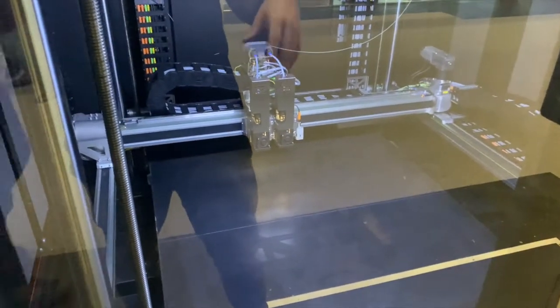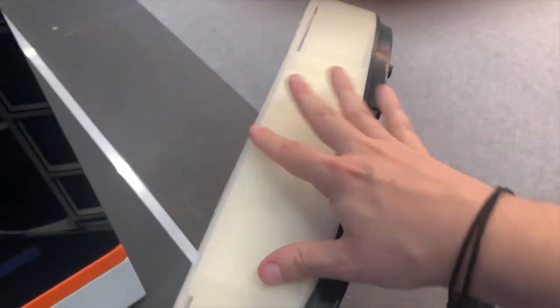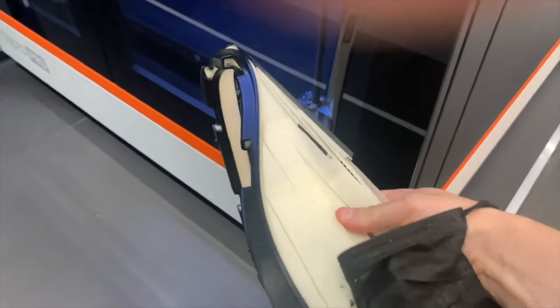With JumpStart, we now bypass manual calibration including Z offset and dual extrusion offsets, so it's super easy to just start the print once you have the G-code. The first layer is always right. The new switch plate — as Francesco was showing at the beginning — has a magnetic surface that you can simply bend once the print is done and pop it off super easily. There's no need for glue. The black plate is made for PA-based materials. The one we were printing was PVA water-soluble support — very waxy material, you break it and wash it out.